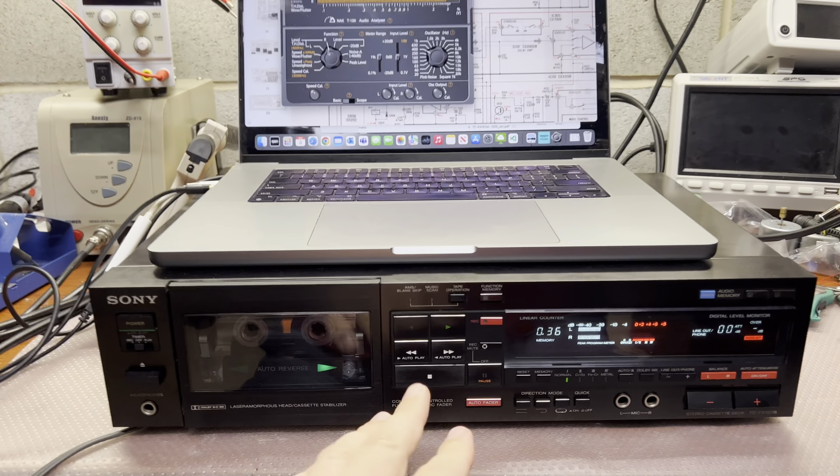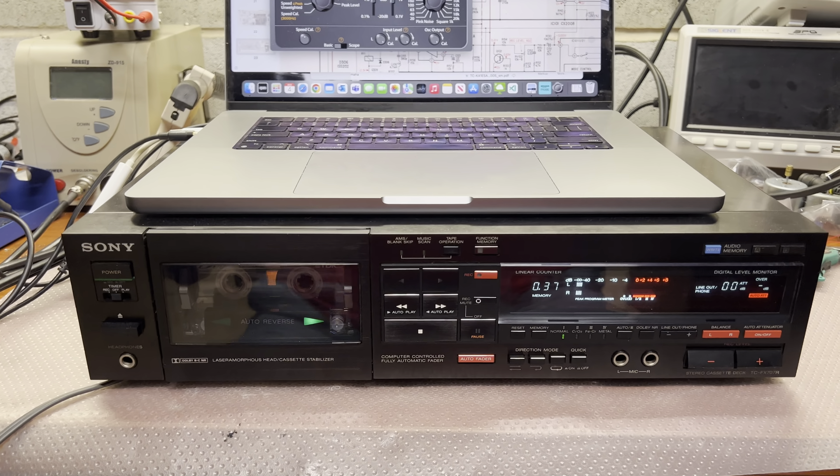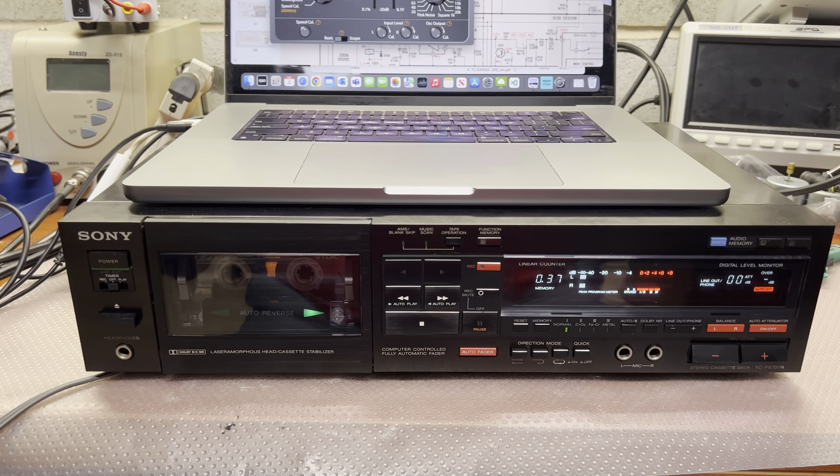That's what we will be fixing today. Our goal is to make THD below 1%. I will be replacing capacitors on the audio path. So I have to replace this one — 4.7 microfarad, C113. Then if you see the signal path, another one, C134. And then it gets to the output jack.